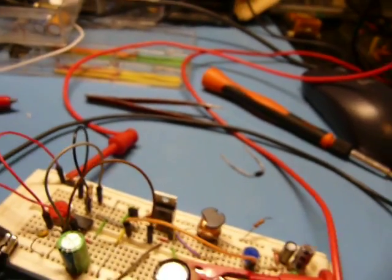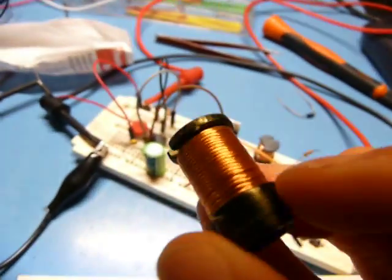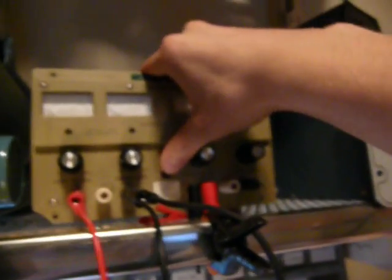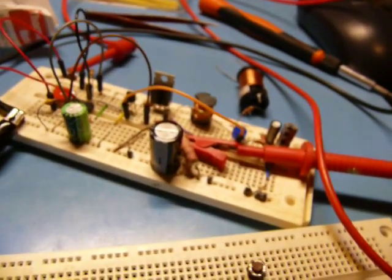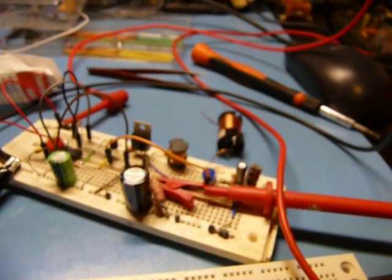As I was screwing around with this circuit, I decided to kind of overbuild it just to see what would happen. I used this inductor here — quite a bit bigger — and a bigger transistor, just to see what would happen. I had my multimeter on the 1000-volt setting, and I went over and flicked the power supply on. I looked down and it said overload. Oops. I kind of exceeded the voltage rating of all of my components: the capacitor, the transistor I was using at the time which was only rated to 600 volts, and the diode — which was actually a 1000-volt reverse-tolerating diode. That was a lot of fun.